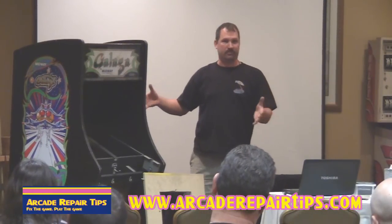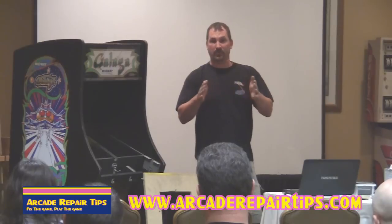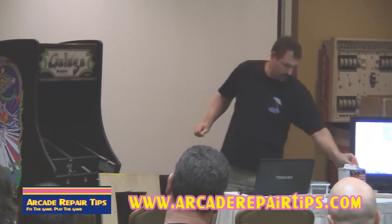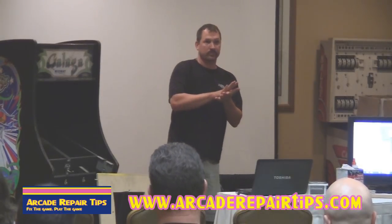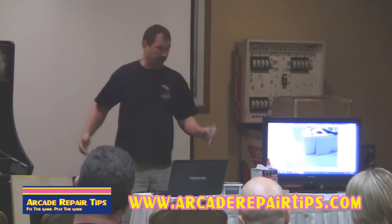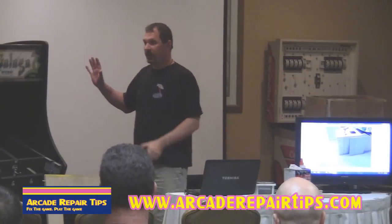You've just ripped the makeup off the cabinet — it's exposed to the air and it's going to start drying out like an onion. You've got to make sure every little pore hole is filled. Just take a Q-tip, some glue, and start dabbing it. Then go back with your 220 sandpaper. What that glue does is fill in the pores, but you still have to go one step further — you need to put some kind of sealer on the cabinet. A good product for this is Kilz — put it on slightly diluted for your sprayer and put a nice coat on there. Suddenly you've got a white cabinet.